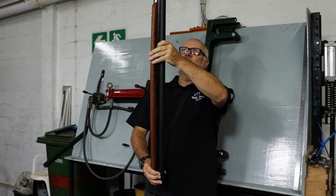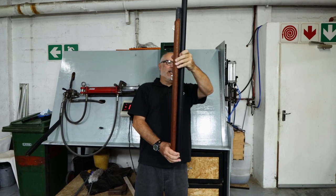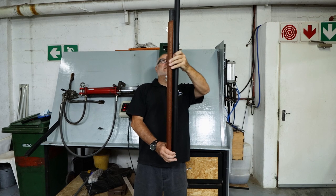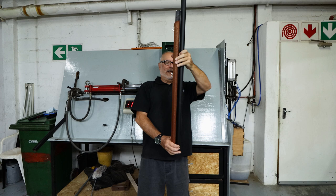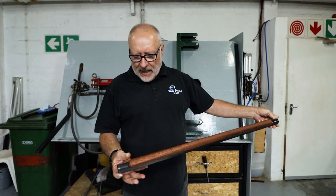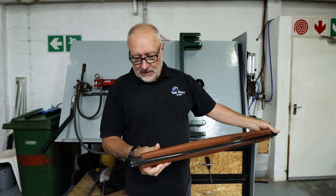I'm just marrying the rails up perfectly. And no light shining through there. Perfectly straight still. For obvious reasons, the carbon doesn't take a set and neither does the timber. The timber would be able to flex a lot more. It's timber, it's a tree. It's perfectly straight. I'm impressed. I heard a creak there, but I don't see any delamination. And that was at 450 kilos.